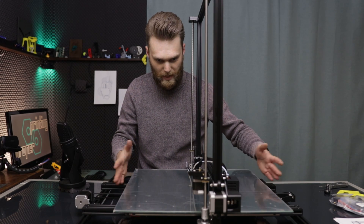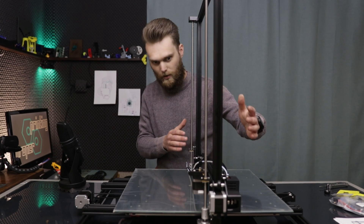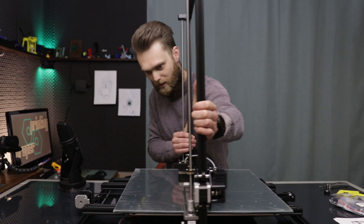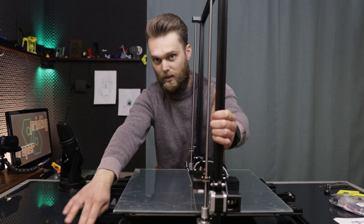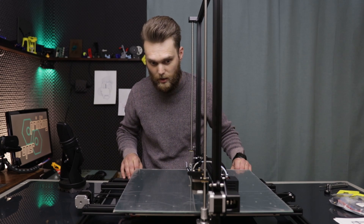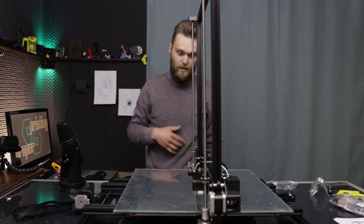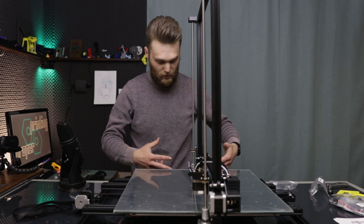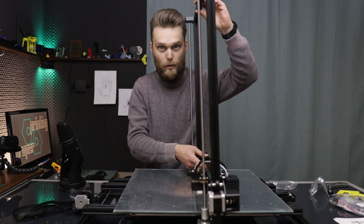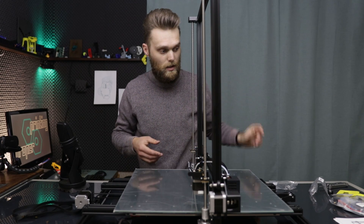The idea is to put this bed into a steady position, and instead of this bed going back and forth, I will let this whole gantry go back and forth over this rail here and here. These lower beams already have those V-slots, and hopefully I'm able to reuse the rollers which are moving this bed. I can hear you thinking — if you're going to move the bottom of this gantry back and forth, then this whole gantry will wobble. And I think it will.